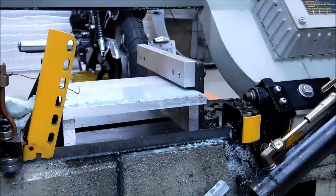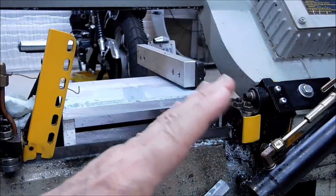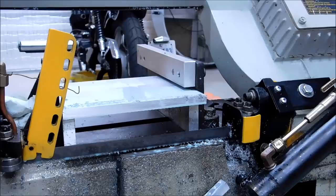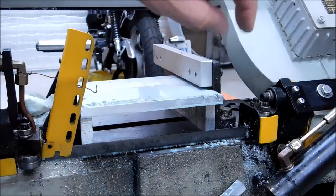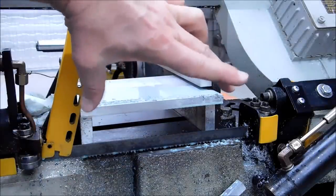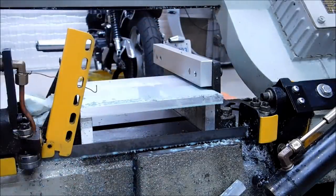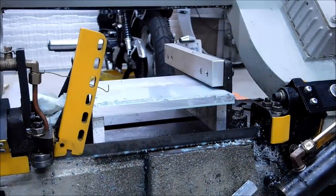Okay, call it 2:49. So: second fastest is laying flat diagonally, jammed underneath our bar is the first fastest, and laying conventional flat as the machine is intended to be used is certainly the slowest. If you have wide plate to cut, consider putting one of these bars in, or C-clamp a piece of stock to the top — the more angle you have, the better. This material is eight inches wide and the throat on this saw is only seven inches vertical, so I can't stand it up; ideally standing it up would be the fastest because it's the least amount of saw contact. Alright, there you go — hope you got something out of that, good luck.